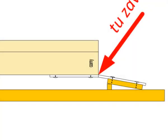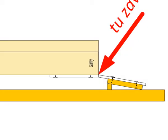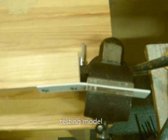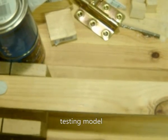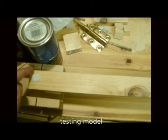Now we will discuss the hinges. I didn't want to use hinges as complex as in a real pipe organ. The easiest way, in my opinion, is to use a strip of material suitably resilient and flexible, yet stiff and resistant to repeated bending. It should give quite a big resistance to the pressing leg but without fatiguing it, and when the pressure releases, the key will return vigorously up and rest on the upper cover of the housing. Wobbling of the key and its lever is not allowed — the pedal cannot dangle loosely while waiting for pressing. I decided that a flat bar of PVC, 3 mm thick, is appropriate. Such flat bars are also available in stores as 1 m long elements, and they are not expensive.